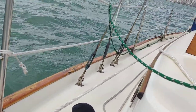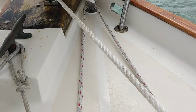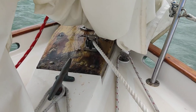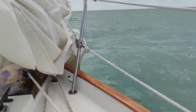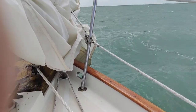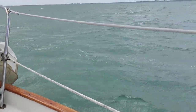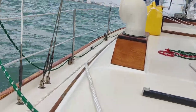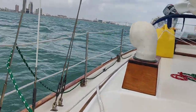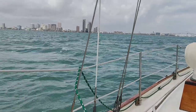Now the snatch block goes back to the winch and it's holding the anchor — you can see that, and it holds it just fine, no problems. All I've got to do is go back, start up the engine, use it to propel the boat forward, and pull in the anchor rode around the winch. If I need to use the crank I can, but typically I can use the engine to drive up to it, do everything by hand until the very last bit, then crank it up, secure the anchor, and off we go.